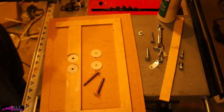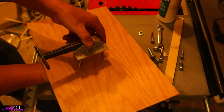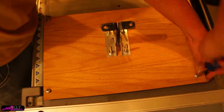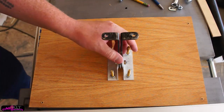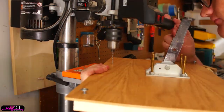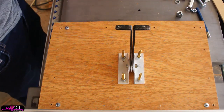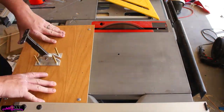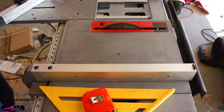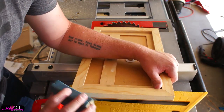I'm using brass bolts used to fasten toilets to the floor because they have such a flat and low-profile head. They're very long but I'll shorten them later. Next I clamp the back panel to the bezel and drill pilot holes for screws. Since the sides of the bezel are joining at the corners, it's foolish to also put screws in the corners. The pilot holes are to prevent splitting, but even with them I accidentally split a corner apart — I managed to re-glue and fix it, but it would have been better to offset the screws from the joints. After more pilot holes I fasten only a few screws to hold the back panel to the bezel, then cut just a little off each side. This cuts both the back panel and bezel as one piece, so each side will line up perfectly. Then some light sanding to clean up the sharp edges.